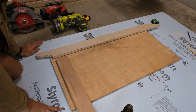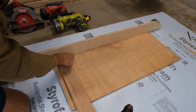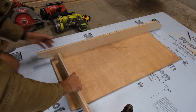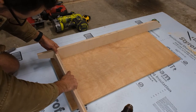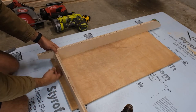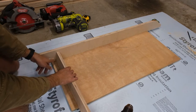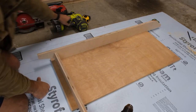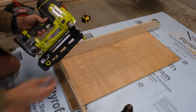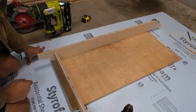You can attach this many different ways, but what I'm going to do is make sure I've got the back of the bookcase up against this piece of plywood. This piece of plywood is only meant to keep things nice and square. I'm going to line up the bottom of the shelf to the bottom of that line, glue it, and nail it. I'm going to use two-and-a-quarter-inch nails and nail it from the back side. I'll end up with nail holes but I'm not worried about that — I'll just fill them.